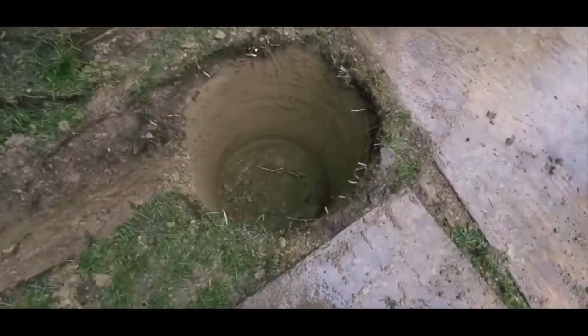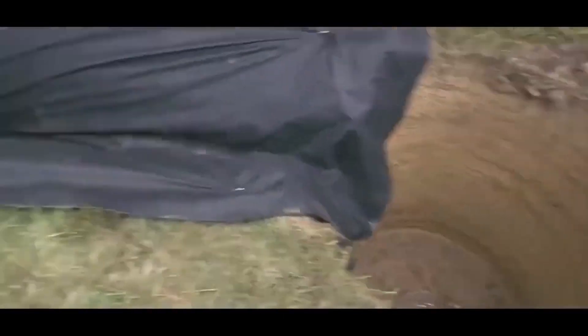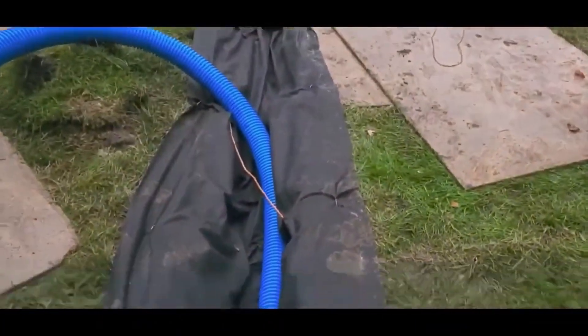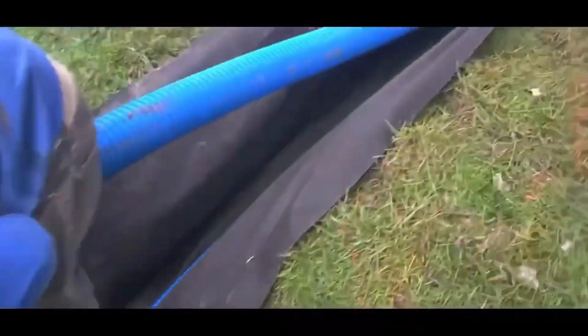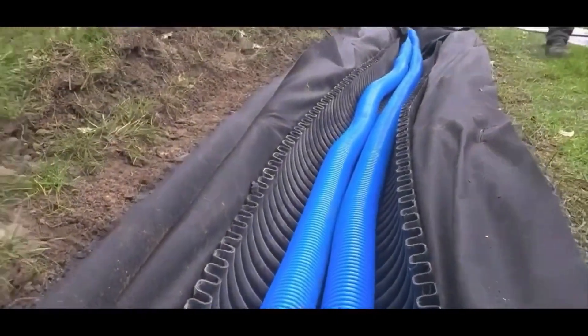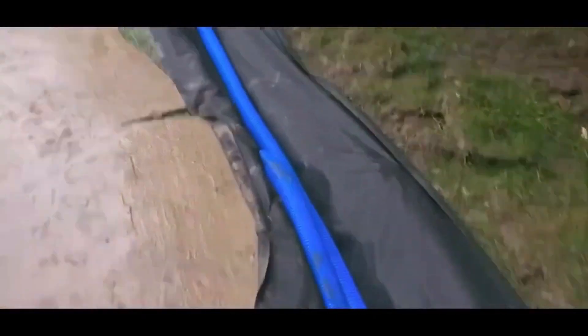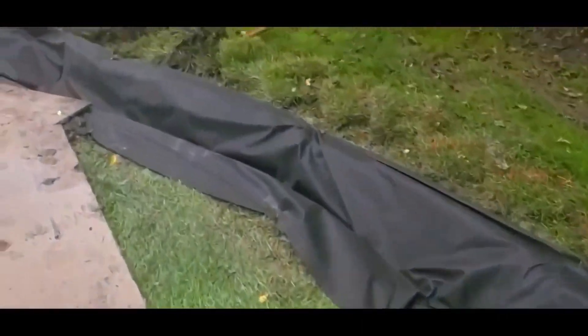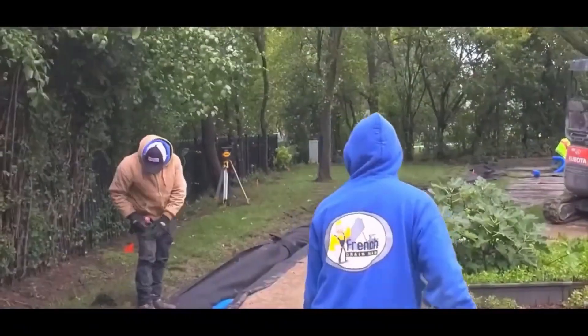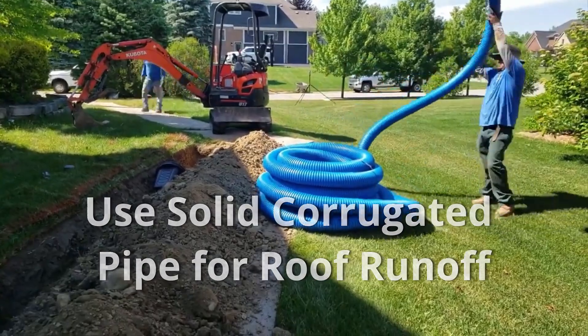Here in Michigan our French drains are enough, but I have subscribers all over the United States and around the world telling me they once in a while get a tropical storm and they're measuring rain in feet. In that case, I'd love to see you combine a French drain with a yard drain. That's why we did this — we took this big job in Bloomfield Hills, Michigan to show you guys. Scott took an 18-inch single-wall pipe and cut it in two because there were three big trees right there. We're going to make sure there's no water in this trench, because those trees will sniff it out. That big single-wall pipe wraps our French drain around it.